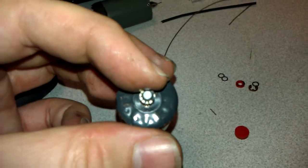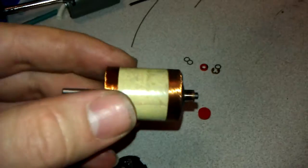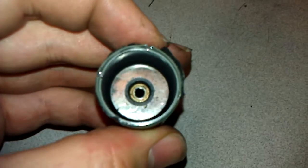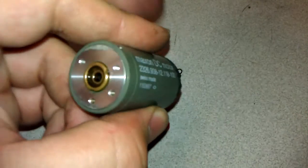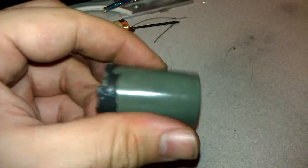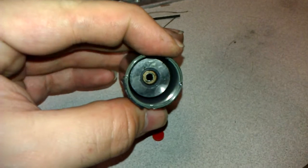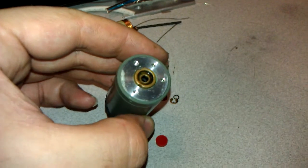Here's the commutator on the back. High mileage, so it's not all that pretty anymore. Down here is the magnet, and chewed-up old pieces of bearing — it really took a beating. Best I can tell, this does not look to me like it's a ball bearing. So what I'm going to do is contact Maxon and ask what lubricant they suggest I drip down this little shaft to keep the thing in better shape.